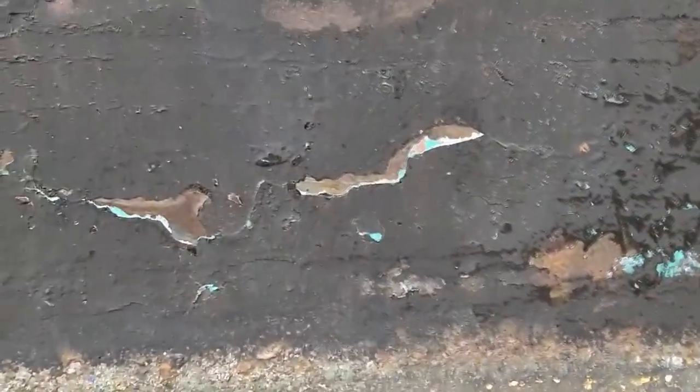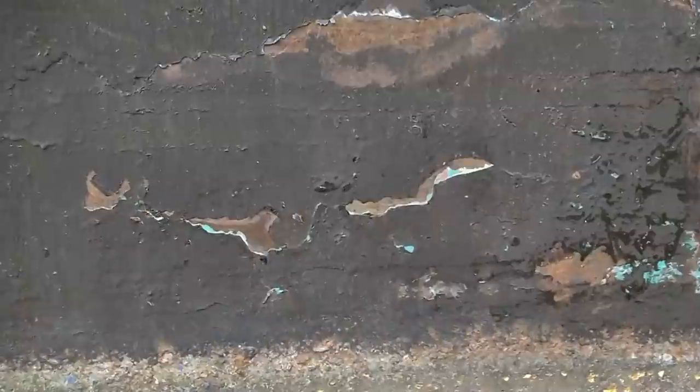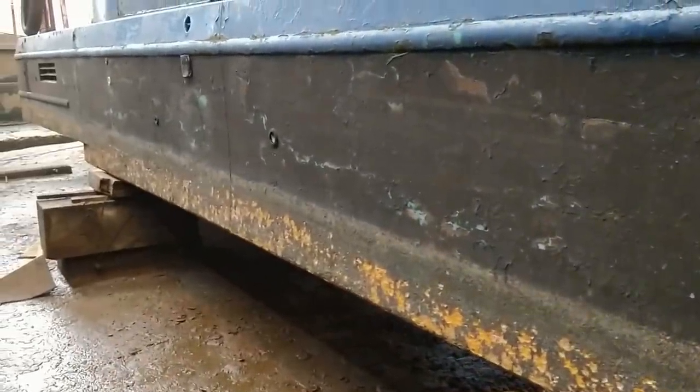Just to highlight what all the scraping and sanding is all about — it's areas like this where there's clearly three or four layers of paint built up over the years, now dried and cracked. What we're just trying to do is get that back to being smooth — not talking new plastered wall smooth, just that there's no ridges — partly so it looks a little bit nicer, but also the bitumen should go on better, and fingers crossed it should stop any areas that are going to open up in future and allow water to get through. It is a very time-consuming and boring job — I think I've mentioned boring a few times already in this video — but unfortunately it is an essential part, because without doing this your boat might not float, and in my eyes a boat's not a boat if it's not floating.